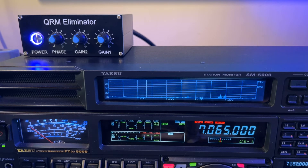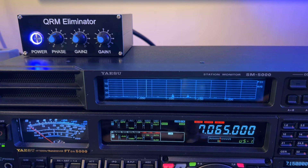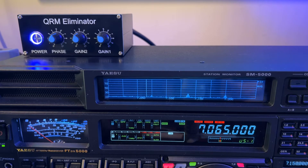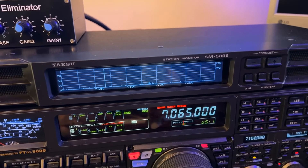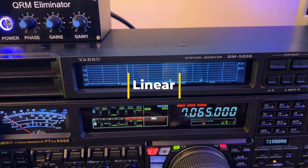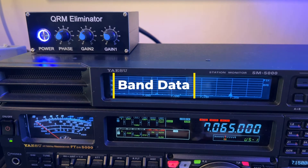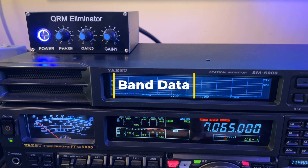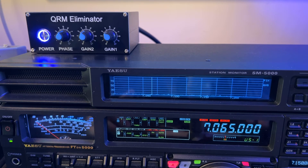So the relay in the rig is actually pulling in a big relay inside the amplifier. The modern amplifiers, especially the solid states, you can buy these control cables - which I have. I have the Elecraft control cable that goes between the FTDX 5000 and my Elecraft amplifier. I also have a control cable that can connect the FTDX 10 to the amplifier - it's a different cable because the back of the radios have different connectors. The connection on the back of the FTDX 10 is called 'linear,' and on the back of the FTDX 5000 there's a different arrangement called 'band data.' You get the right cable to go between the radio and the amplifier and everything is electronic - it tells the amp what band and when to transmit.